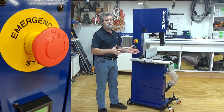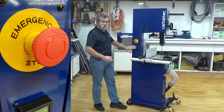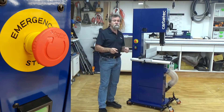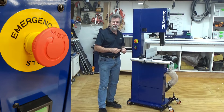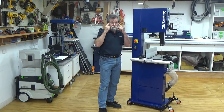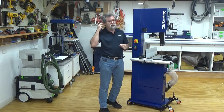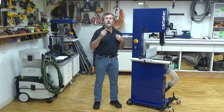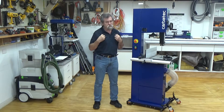Before making adjustments, switch off the saw and bring the machine to a complete standstill. Stop the machine before attempting to back the work away from the blade. Stop the saw immediately if the blade develops a click — check the blade for defects. Safety glasses must be worn, long and loose hair must be contained, and hearing protection must be worn.